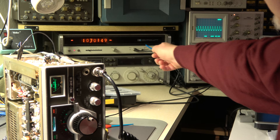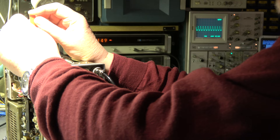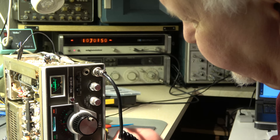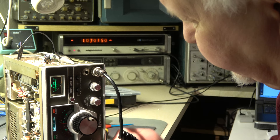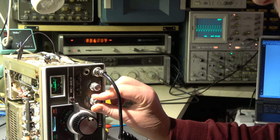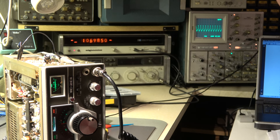The result for LSB has to be 1.5 kHz above. I go to the other trimmer for LSB and try to align it. A quick check — the tone pitch is nearly the same. The small difference we can hear is due to the filter, which is not absolutely perfect. The old crystal filters are not perfect — the old analog filters have some problems. Let's go to CW.